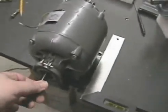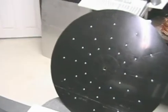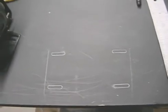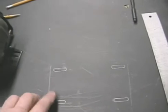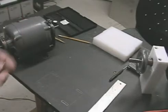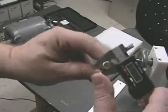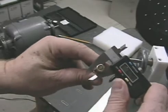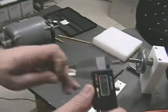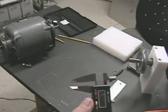We'll go ahead and mount the wheel, which is now coated with plastic on both sides to add rigidity. I've laid the motor in place and marked exactly where I'm going to mount it. With the motor out of the way, I can drill the holes for the mounting bolts. Use calipers to determine the size of your bolt and select the correct drill size — you don't want any play in this rig.